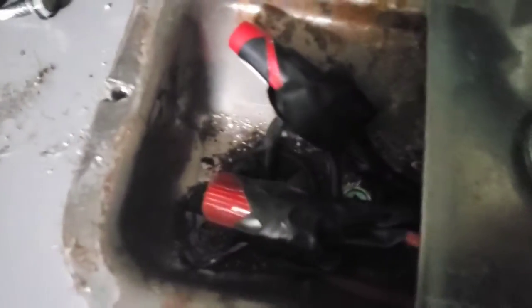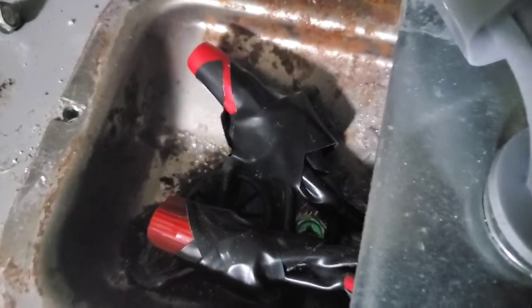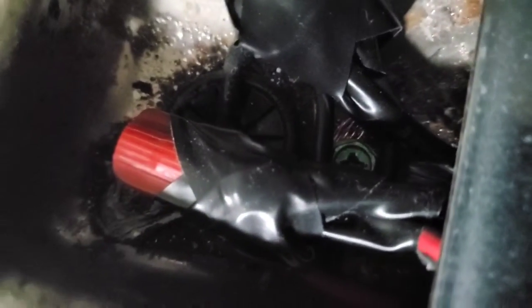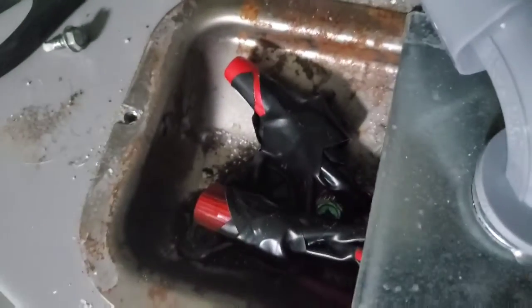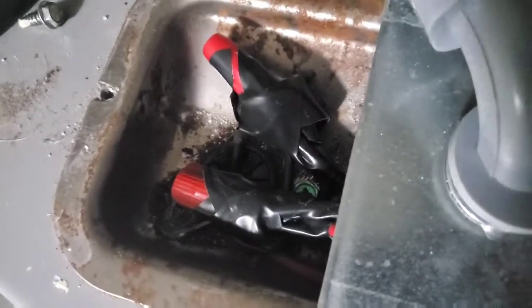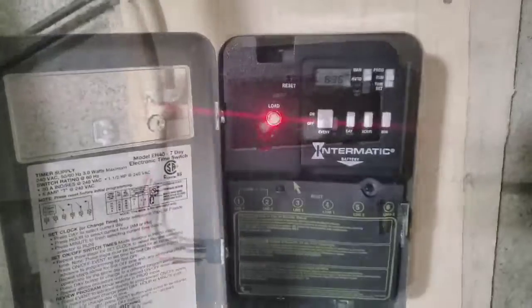The load lights are on, meaning it's getting electricity through this wire to my water heater. Here is how you hook it up to the water heater — this is from terminal 4 and terminal 6. That little green screw you see right in the middle of your screen has the ground on it. There's a lug with 120V and the other one has 120V — splice those together, cap them off, and tape it. Not a very pretty job, but it works.